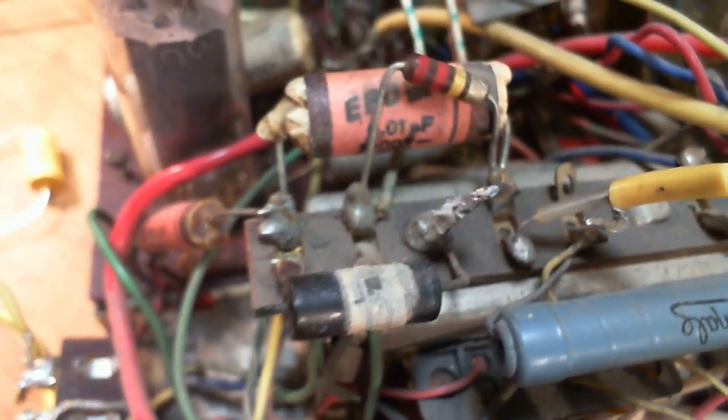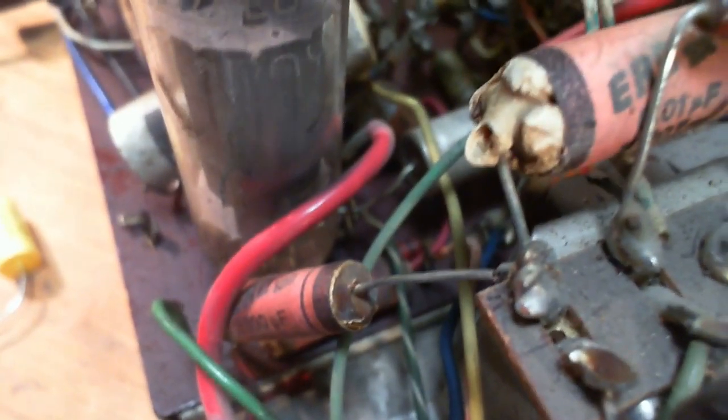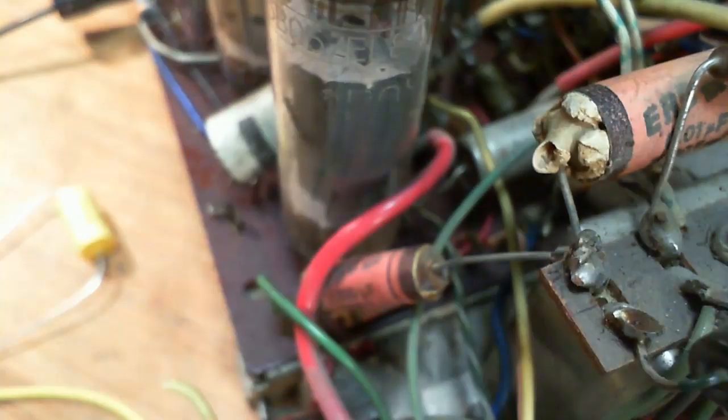Okay, to the problem at hand. I don't think there are many options here. Now, what about this wire wound resistor? I'm going to try to put a wire wound one back in here. You get the high thermal capacity. Let's continue on with the testing of the capacitors, with them sitting in there.